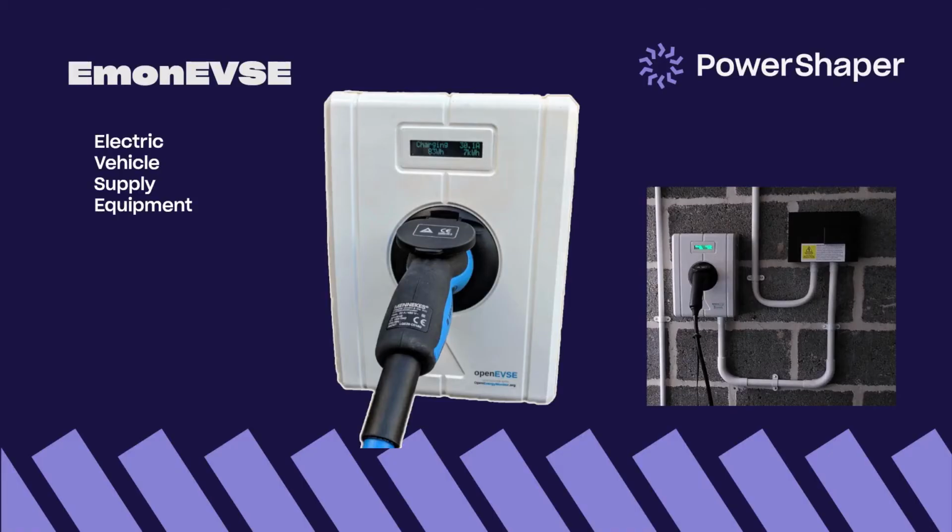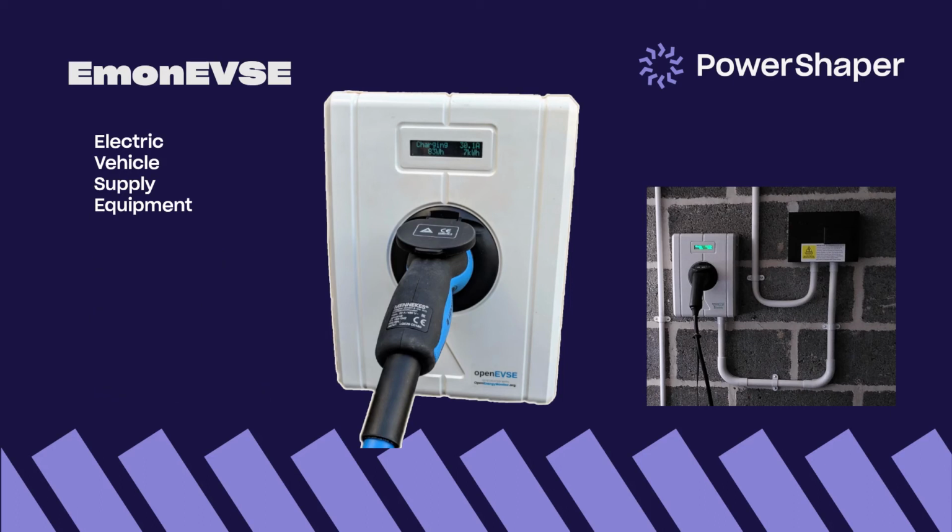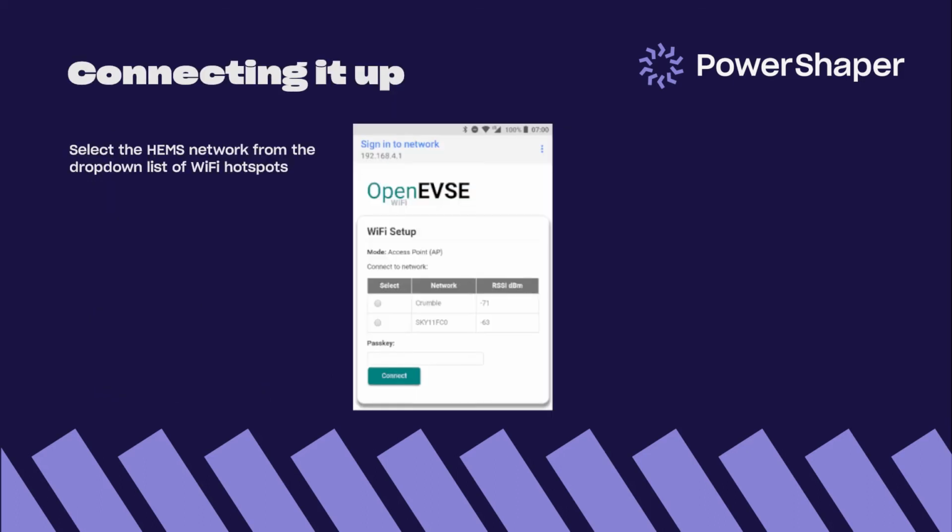So next up, the EVSE connection. It's a very similar sort of process. Again, it puts out its own wireless hotspot. So you need to connect to this with a mobile or laptop. The SSID will be something starting with OpenEVSE. It will have a password this time. The default password is just the word OpenEVSE, all lowercase. So once you've connected to that, you can then navigate in a web browser to http://192.168.4.1 as shown.